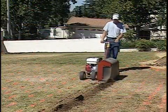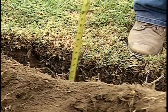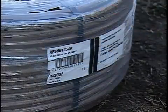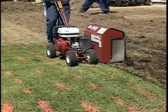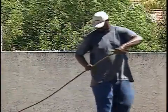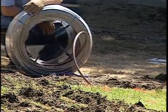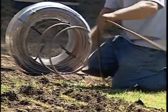Next, the trencher is fitted with a 1 inch wide blade and trenching begins for the lateral lines. This installation is using XFS subsurface drip line with an emitter flow rate of 0.6 gallons per hour and emitter spacing of 12 inches. While trenching continues, the drip line is also being installed. Notice the technique being used to take the twist out of the drip line, how the self-extracting coil feeds out smoothly without need for additional equipment, and how the tubing lays flat.